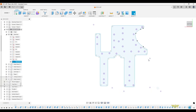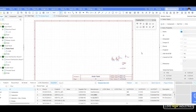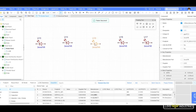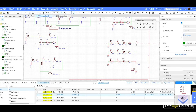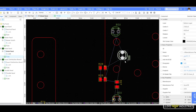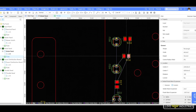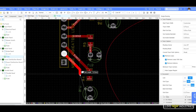Then I jumped onto JLCPCB's EasyEDA software and drew up an electrical schematic. That then transfers over to the actual PCB design, where you can import that DXF sketch from CAD, and you have an outline of the PCB and markings of where each LED should be positioned. You grab all the components you placed on the schematic and place them along the board exactly where you need them to be. Once everything was in place, you can route all the connections to where they need to go, creating vias to route to the other side of the board as needed.